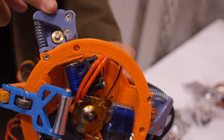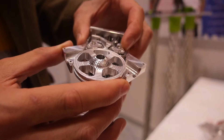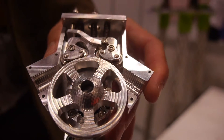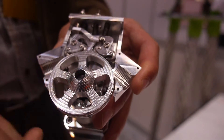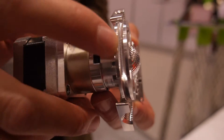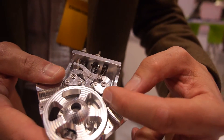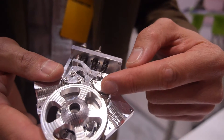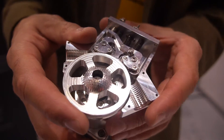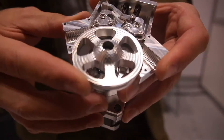In order to solve this problem permanently, we invented this — our really high force, high pressure filament driver. Instead of using the point of contact between two cylinders, we actually wrap the filament around the drive wheel. So instead of between one and three teeth driving the plastic, now we have about 40. We have a lot more friction, and the pressure is about 10 to 15 pounds. When these bearings are pushed away from the wheel, the opposite ones press harder — so when it would traditionally begin to fail, this one actually gains driving force by increasing internal friction.